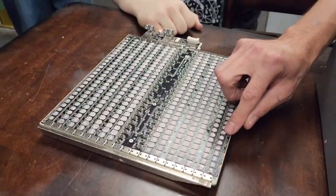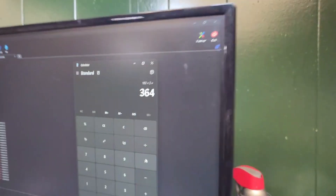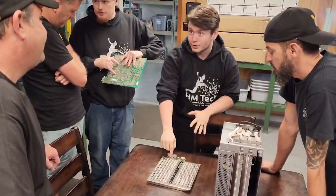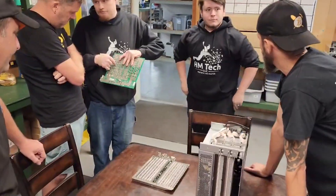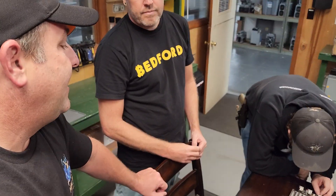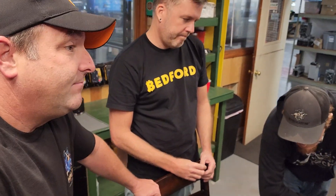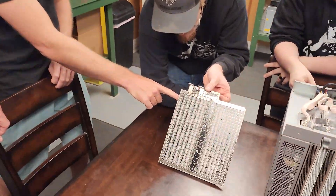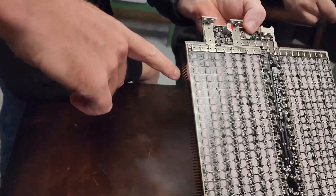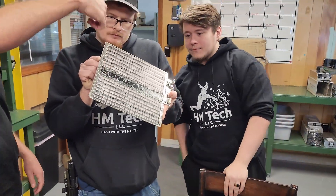We just found out that one hash board has 364 chips — lots of chips, low voltage, high density. Low clock frequencies, low voltage, low amperes — they don't generate a lot of heat on the board itself. That way they can run at a higher ambient temperature. Pretty smart. And the crazy heat sink has heat pipes in it — copper heat pipes inside the heat sink.